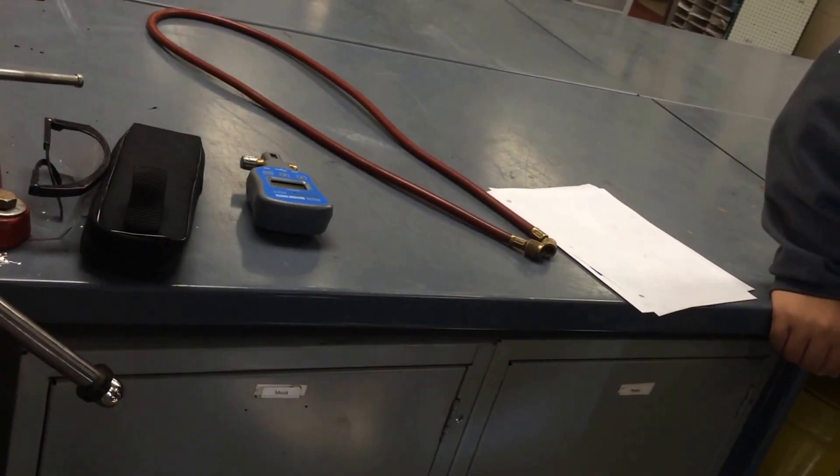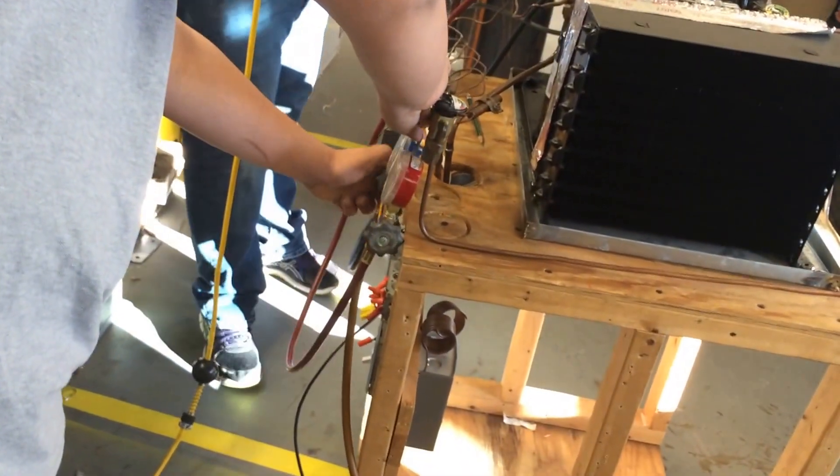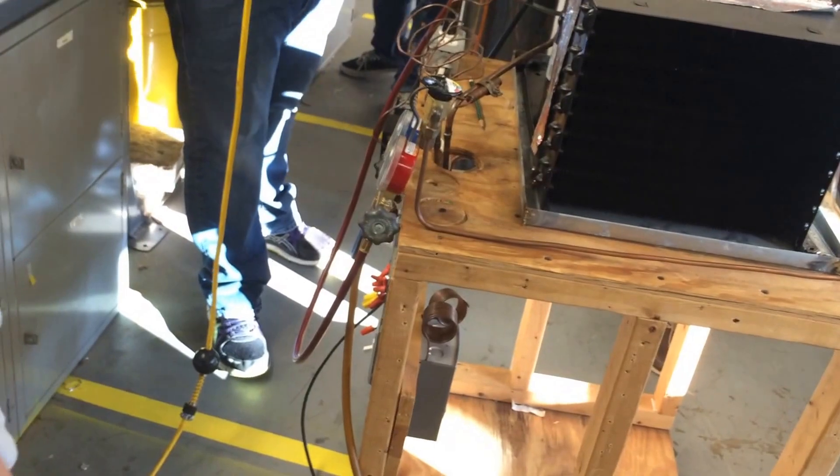Go ahead and open up the blue gauge and get it up just a little bit more above 10 pounds — you just need a little bit of R22 to mix in with the system. Let a little bit in, just purge your hose. It's got air in there anyway; we're going to add a bunch of nitrogen. You got above 10? All right, that's going to be good for the electronic leak detector. Shut the tank off and switch the hose now to the nitrogen tank.